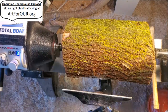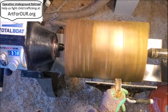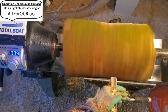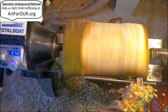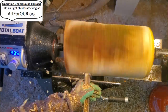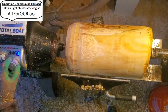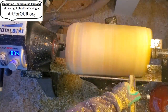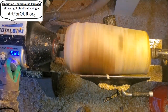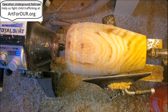I had a big chunk of elm wood that was obviously very green. Went to town on it to see what could happen. I'm kind of digging the cracked look filled with resin. I know full well this green stuff's gonna crack like crazy, and not only is it what I have access to right now, but I'm kind of liking this cracked look. As you'll see, it took me forever to finish this project, and as I sat there on my lathe, it went crazy with the fissuring and cracking down the middle, which turned out pretty cool, I think.